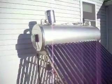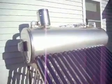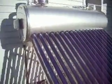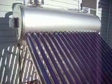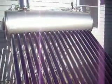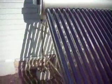When it gets down below 20, I switch over to using this for household water. I have a heat tape on it so that the water lines don't freeze. They have no issues with that. It's self-limiting. And I use this for radiant floor heat. Works pretty good, and we can also pull our domestic off of it.